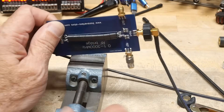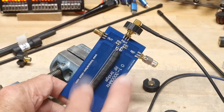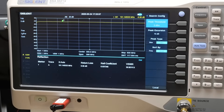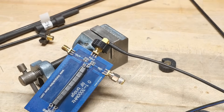You can use your spectrum analyzer on the cheap with one of these bridges. You can also do it with a coupler — I did a video on the difference between return loss measurements with a coupler versus a bridge. A bridge seems to be a little bit better, but not by much if you have a good coupler. This cheap bridge zeros out at maybe minus 35 dB return loss, versus maybe minus 50 with a really good setup. But you don't really care because your antennas are never that good, so these cheap ones are plenty good for garage use.